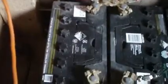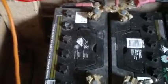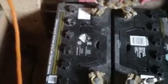So anyway, I needed some decent batteries. One night when we were out shopping in Levin, in the Warehouse, I just plunked out and bought this battery right here. It's an LM34C car battery. It's just a starter battery, nothing special about it, an ordinary Exide car battery. 50 minutes reserve capacity, 300 cold cranking amps, and no specified amp hour rating, although I've since learned it's probably about 30 amp hours, but you wouldn't want to treat it like a 30 amp hour battery, because after all it's a starter battery,